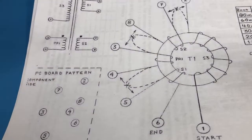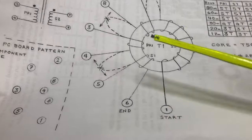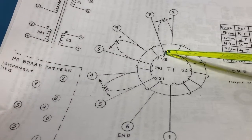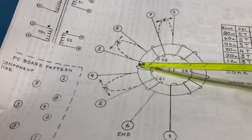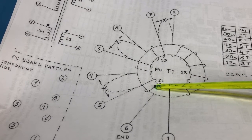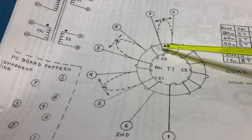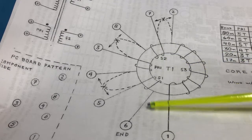There's a special technique outlined in the manual. Basically, instead of winding all these turns separately, you wind a single continuous wire — 30 turns around, then you form a loop out here, come back and do another three turns, form another loop, come back, another three turns, form a loop, and then another three turns. For each of these loops you cut them, which saves you the fiddling around of winding each one separately and keeps it all in one piece.